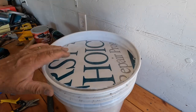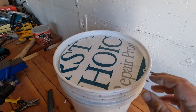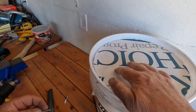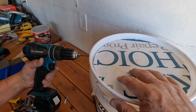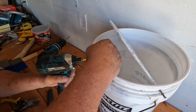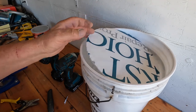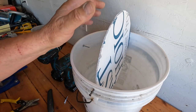To make this work, the mouse has to be able to walk out on the trap door and have it be stable, then have it dump when it crosses center. First determine which side the ramp goes on — the mouse walks across and when it crosses the center line it goes down. To prevent it from flipping all the way over in the wrong direction, I'll drill a hole right underneath to stop it going down on the entry side, and insert a screw there. Then on top, add another screw on the opposite side to stop it from flipping past center that way, so the door returns on its own.